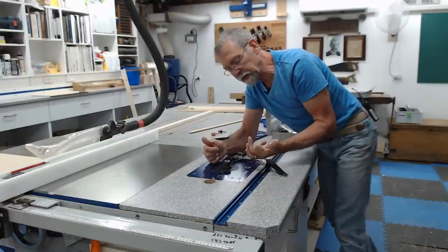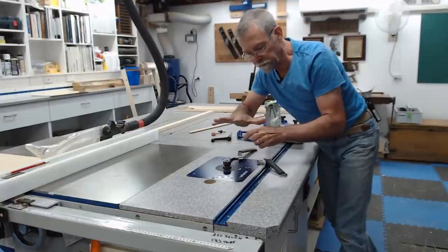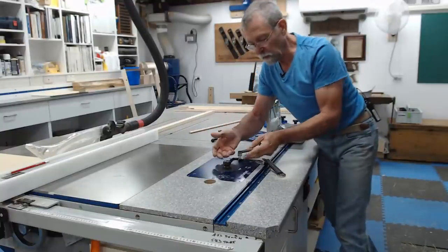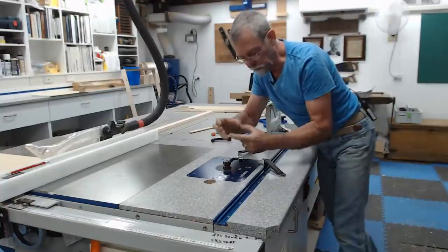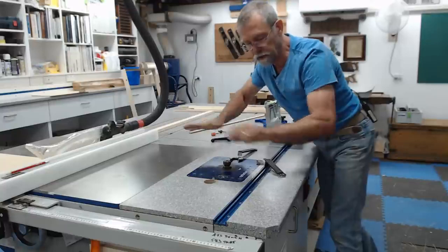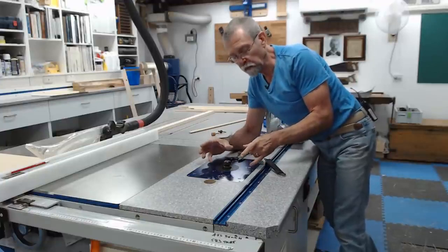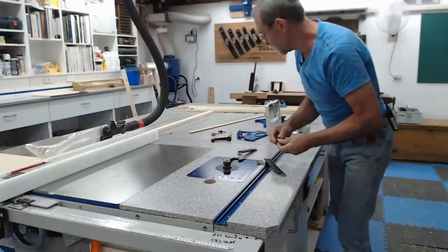And I was thinking, well, that's going to be a pain in the neck. But what happens is there's a diffuser at the top, like a heap of fan blades, a turbine style blade in it, that makes all the air go out flat. So it's not pushing the dust back up in your face. The air is still allowed to be pulled down through the top, and the router throws all the dust out sideways, and it drops down and goes around the outside of whatever you've got, the cupboard or the cabinet, or a box if you've got the router in it, and it goes straight to your dust collection. I like this router. I like it a lot.